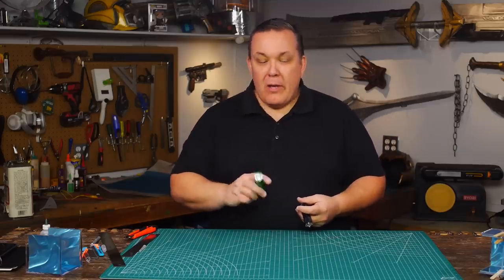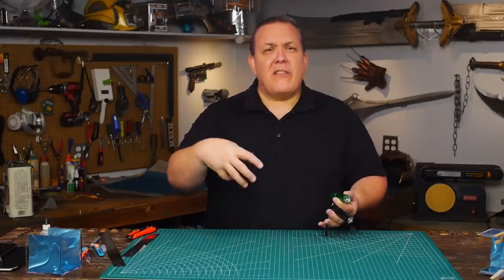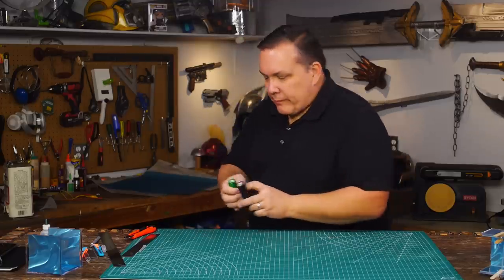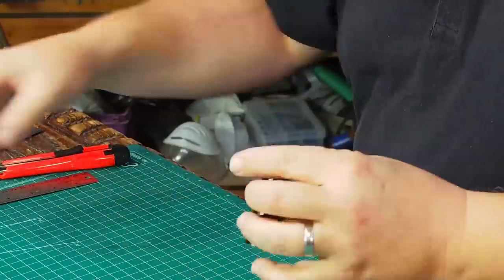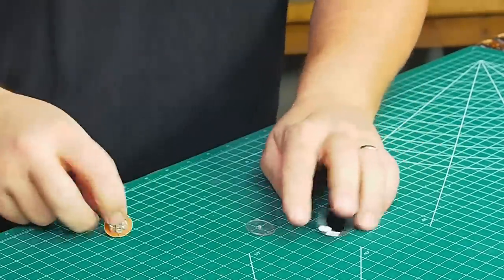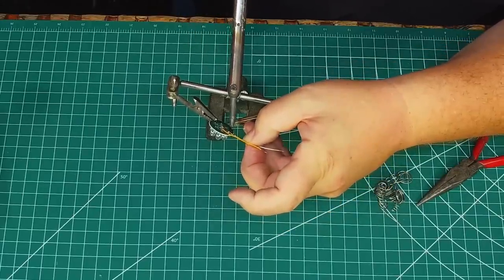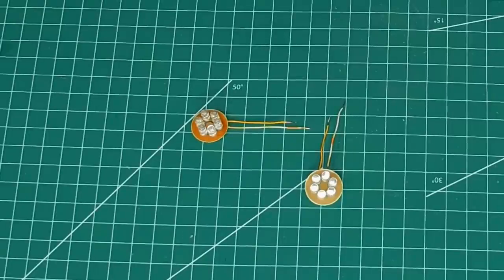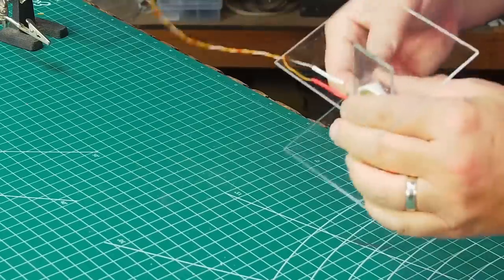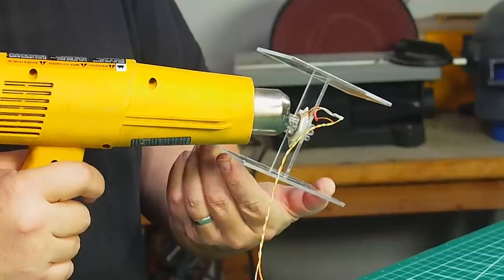To light up the inside of the cube I'm going to use some cheap one-dollar flashlights. I'll take these apart and just put the elements inside. You could use LED fairy lights and things like that, but I want these because they'll be the brightest. To disassemble them: unscrew the end, remove the clear lens by poking it with a small screwdriver and prying it out, then push the LEDs out from the inside. I double-check that the spring is the positive side. I remove and replace the flashlight connections with Cat 5 wire — keeping colors consistent and using solid for the positive. To stick the LEDs to the plastic I use double-stick foam tape, then solder the wires together. I place shrink tubing over all the exposed soldered connections because I've had too many props get an electrical short right when I need them.